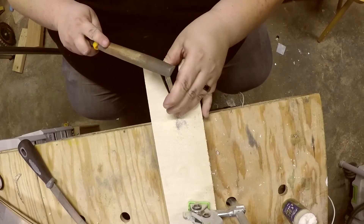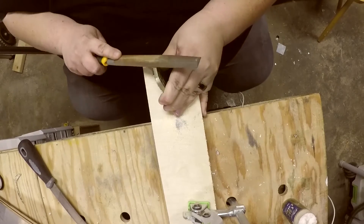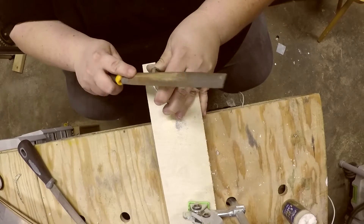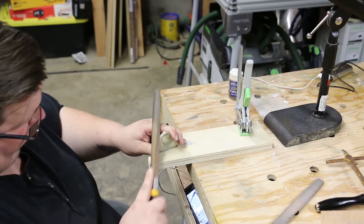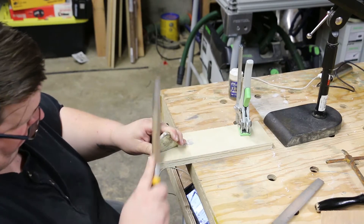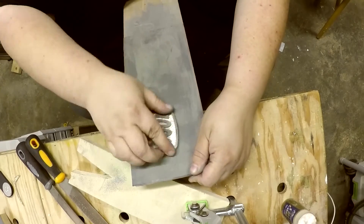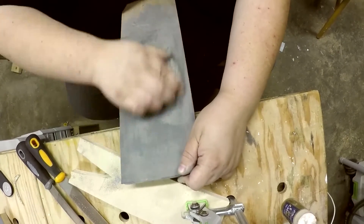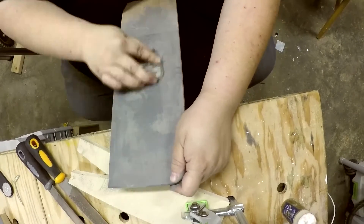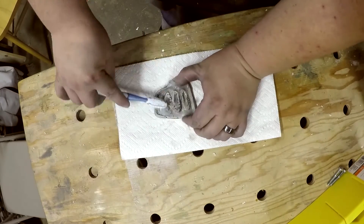Then I'm just filing the edges flat — they're not totally perfect where the cut is. I could have cut this out on the porta-band with the table as well, but sometimes I find that with stuff like this hand tools end up being a little bit better — you end up with fewer mistakes because you're taking off smaller amounts of material. Then back to sanding: I'm sanding the backside, which is rough, on the sanding blocks that are just sandpaper glued to plywood and MDF. Then we clean all the dust and stuff off.